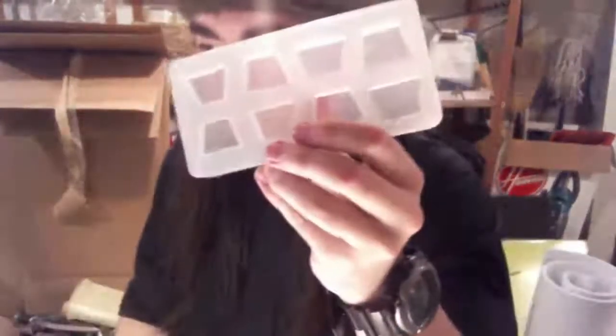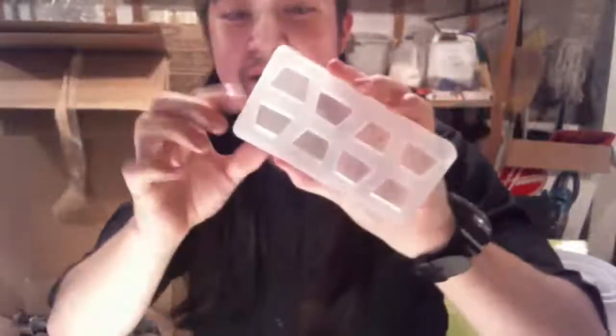This mold right here is my mold for making Omni wrenches that have LEDs in them, because the vents on both of the heads have those little trapezoid pieces, and that's what these are. So I have to put casting resin in that. But it's about the same thickness, if not a little thicker. But the mold did its job a little too well, and actually picked up on the scratches on the side, because I had to cut the original pieces with a bandsaw. Then I sanded it as best I could, but the scratches were still kind of visible, and in the castings, when I use this mold, you can see the scratches. So I've got to redo that. I'll probably use this, and instead of just getting rid of the scratches, I'll do a complete polish with it. So yeah, plastic is hard to come by around here, so I can't wait.